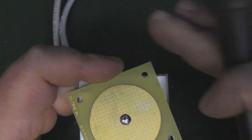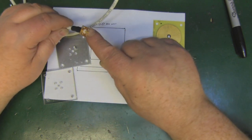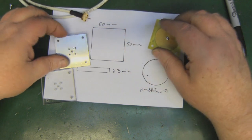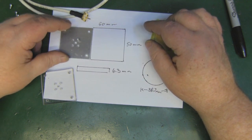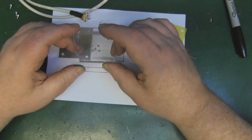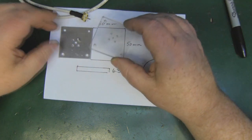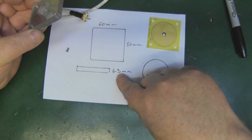It's a pretty simple design. We've got the back reflector made out of aluminum - the screws are tapped into the back which holds the connector in place. This flange connector has a pin going all the way through that solders directly onto the main driven element, and I think it's crimped onto the coax. The back reflector is 50 mm by 50 mm, 2 mm thick aluminum, so you should get a good front-to-back ratio. This dielectric is perspex - you have to be careful using dielectrics because they can affect the center frequency of the antenna. The dielectric is 6.3 mm thick.